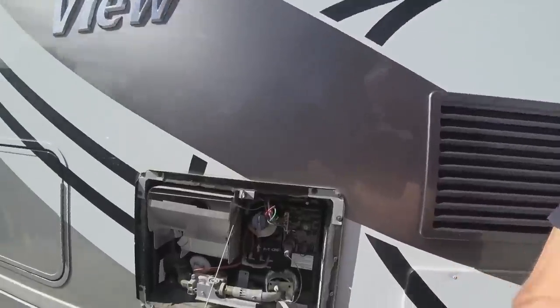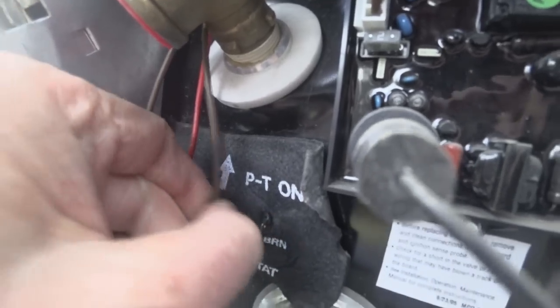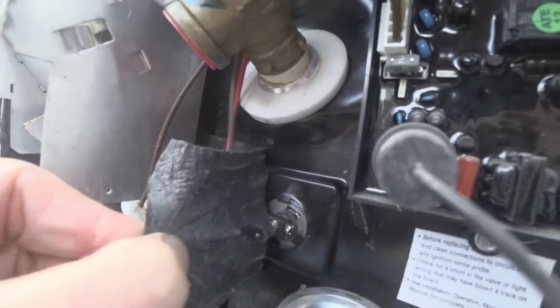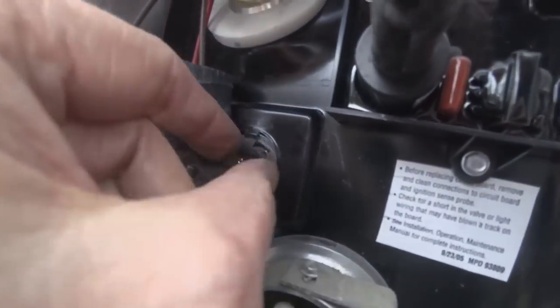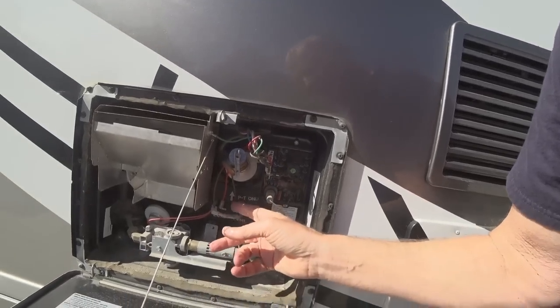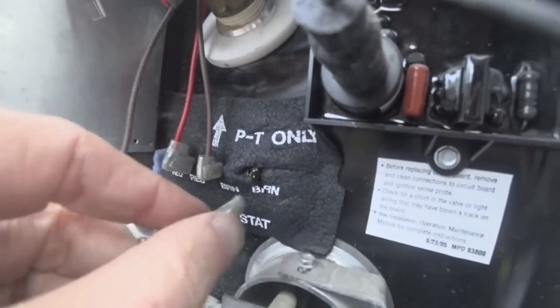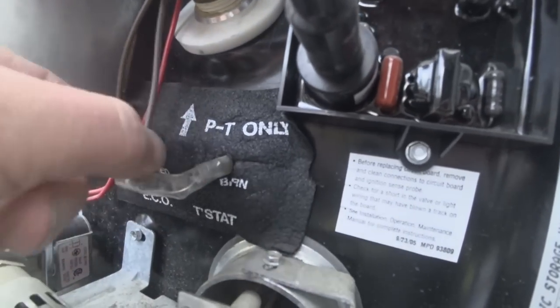Let's take a walk outside and look at the water heater, which is part of your fresh water system. When this coach originally came, there was a little thermostat right here. Those two wires hooked up and that was a 140-degree Fahrenheit setting, which is way too hot. I don't like to get burned by hot water, and in the shower it's a real pain having to adjust between hot and cold. So I switched that out — it's pretty easy to replace. You just unplug the connectors, there's a little spring in there, put the new one in and you're good to go.